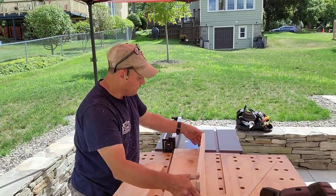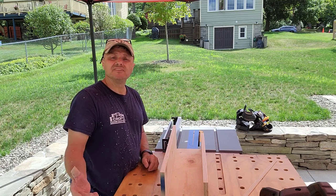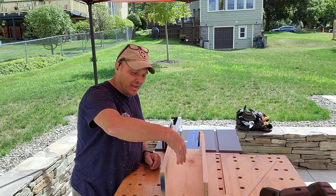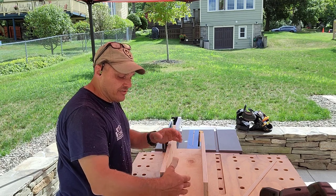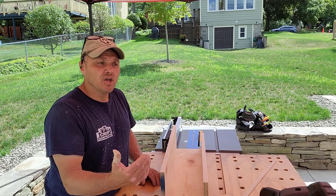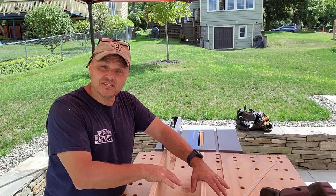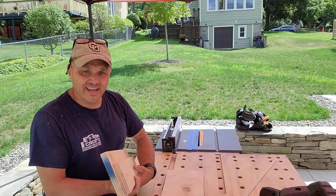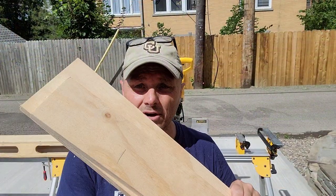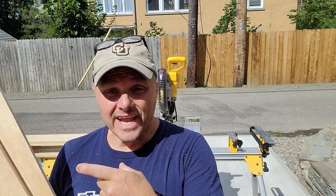So the idea would be more or less to build it like that. The crown would nest tall side down in the proper orientation as far as ceiling and wall. And then it would hang off the bench - that's where you're able to cut the cope as it would install, looking at the plumb and making sure you remove all that material. Now it's just taking some material off of the two uprights - they don't have to be as long as the base. I'm going to say this is 24 inches and take these down to about 18 inches. I've made my marks at 18, checked them against the base, it looks appropriate. Then I need to get my pocket hole jig out and do some pocket holes, then assemble and show you what I've got.